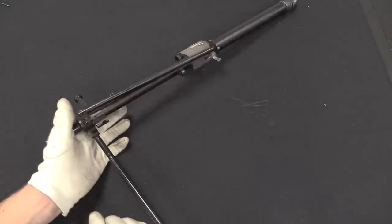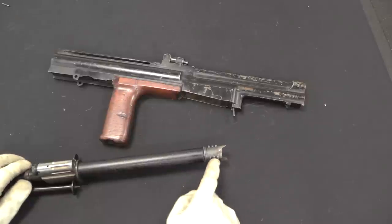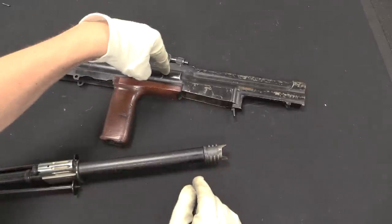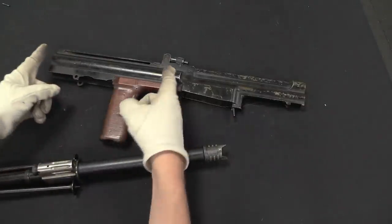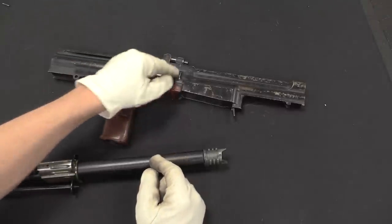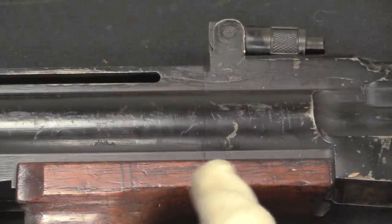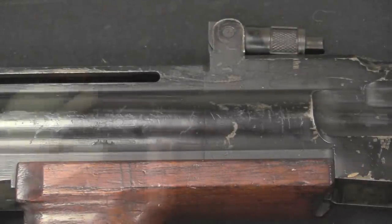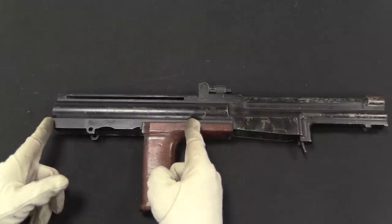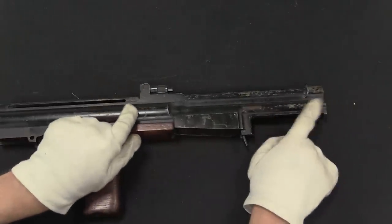This is not one of the most confidence-inspiring bipods I've ever seen. The legs are very close together, which wouldn't make it particularly stable, and the locking system would be considered completely too flimsy in the field. But of course this is a prototype, and had it gone into production they would have improved that. It does also have a bayonet lug under here — interesting to note, so you could fit this with a bayonet. Now if we consider production of this gun, one of the things that's going to occur to people with manufacturing backgrounds is that you have to cut interrupted threads for the barrel right smack in the middle of this long receiver, which is going to be basically an impossible job to get a tool head that's this long to accurately cut interrupted threads.